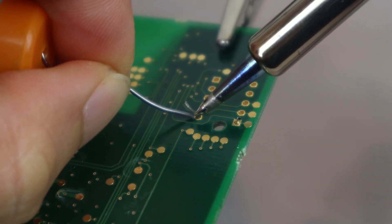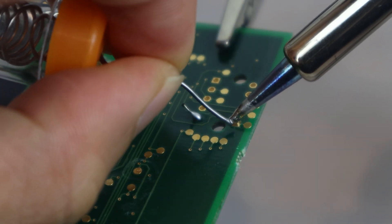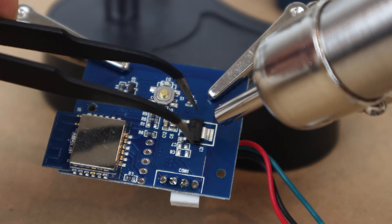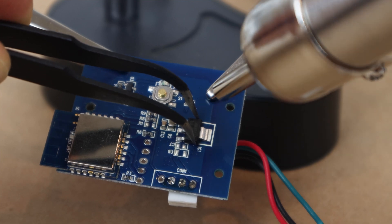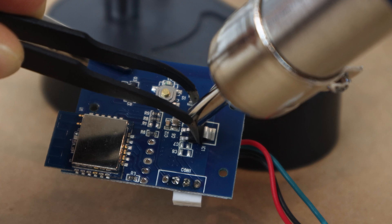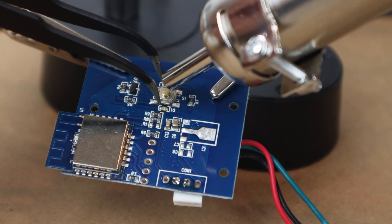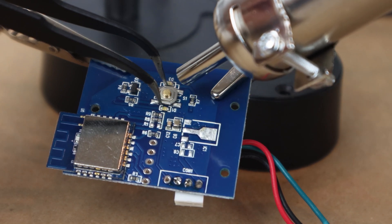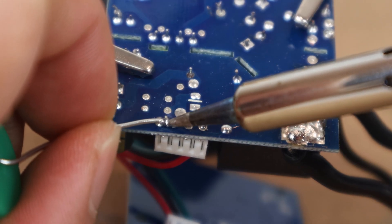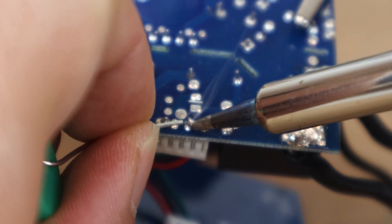Overall, I really enjoyed this soldering station's ease of use and ability to set accurate temperatures at the touch of a button. The tools both heat up quickly and allow me to solder, desolder, and apply hot air where I need it. The temperature ranges are broad and can be calibrated using the offset compensation feature, and the handles don't get hot during operation. There's hardly any setup involved and you can get started soldering out of the box with the included tube of tin. I hope you enjoyed this review — ask me any questions in the comments, I'll put a link to the product in the description, and don't forget to subscribe.